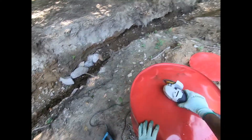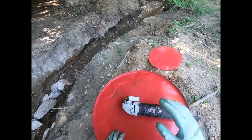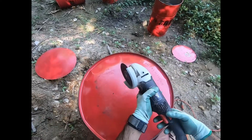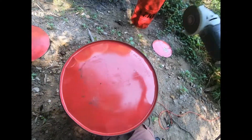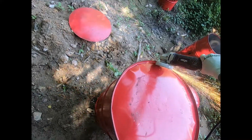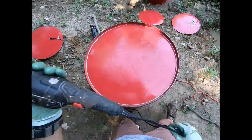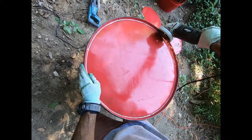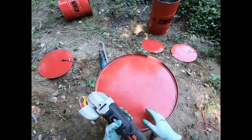What's working for me is a combination of the grinder and the Sawzall. The grinder is scoring the cut and then the Sawzall goes through it like butter. Make sure you get your safety stuff on — gloves, earmuffs. If you have glasses, you should put them on as well. Now that I got everything scored, I'm gonna make a cutout here so I can get my Sawzall in there. You can go ahead and cut the whole thing with the grinder, I just find it easier and quicker to do with the Sawzall.